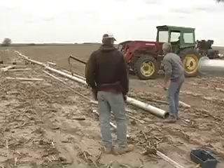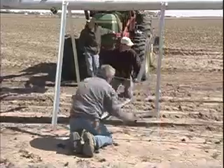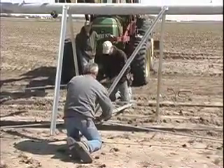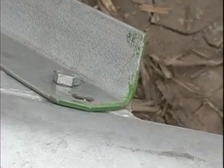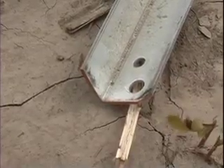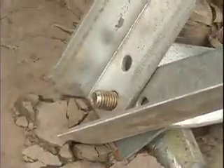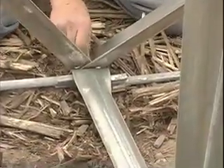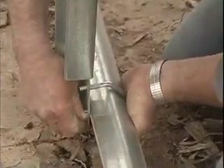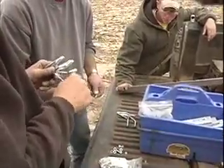This first one is a 179 — it's four long pipe, an 18-footer, and then a 4-footer. That's one arch. The V-jacks are different lengths; you've got your inners and your outers. The inners have two notches on them, the outers have just one. On this one you've got green, gray, gold, orange, orange, gold, gray, green — the ends of them are painted. You just put them together, your truss rod's at the bottom, and it forms an arch. You've got your half-inch bolts for the V-jacks and your five-eighths for your truss rods and spreaders. There's a lot of bolts.